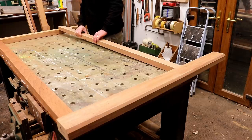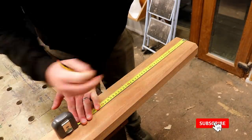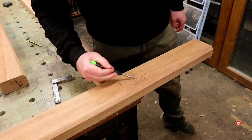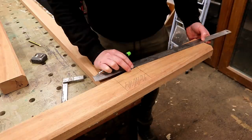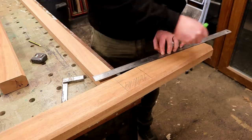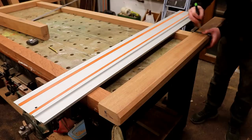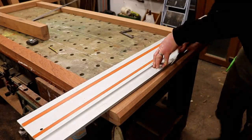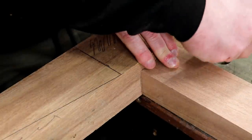With all the milling done I could start offering things up and marking up where I need to cut the joinery. I also marked up a halfway point to the bottom of the leg and then using a straight edge I marked a line between that and where the bottom of the horizontal rail of the headboard would be, creating a nice taper for the legs. At the top of the leg I marked a halfway point again and marked another straight line on the opposite side to create an interesting shape for the leg which I thought would look really cool.